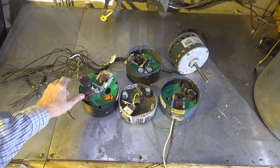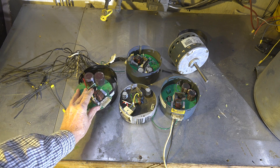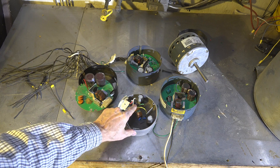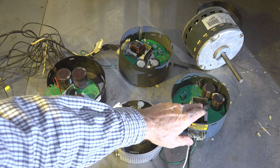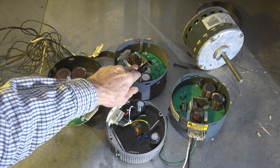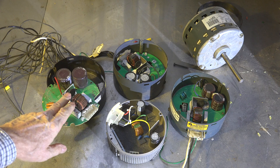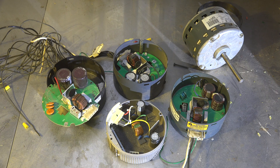I can see it on all these things. There's one right here - it's that little black disc. I'm gonna get closer on these in a minute. That little black disc is right there, there's one right there, and there's one right there. That's a thermistor. What it does is, if you get a spike in the line, it acts the same as these power strips that are supposed to be surge protectors. The thermistor - if there's too much power going through it, it overheats and increases its resistance.